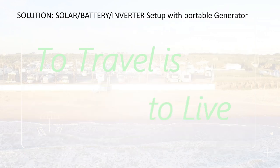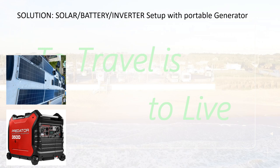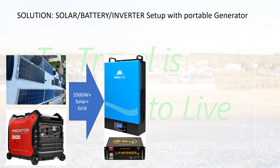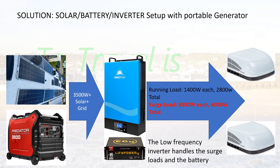What is the solution to this problem? First, change the system to something more efficient. In this case, a solar battery inverter. You put solar on the roof, you buy a small inverter generator, you feed that plus the grid power into a low-frequency inverter — that's what I only choose. And a battery — LFP normally works really well. With that, you're able to power your air conditioners and pretty much everything in your coach.